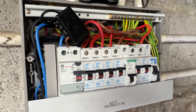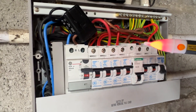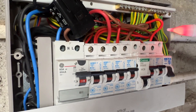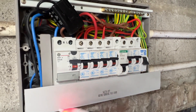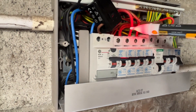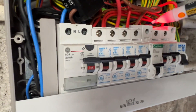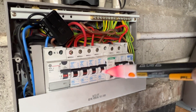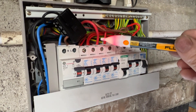All right, we'll try it in the fuse box — a bit of dodgy one-handed work going on. Here comes the tester. We're about six inches away and it's lit up. So that's a bit closer, but that's not going to help me in the fuse box. Obviously it's live at the bottom here — this is where the mains comes in through the fuses or circuit breakers. To try to detect an individual cable in here, you're not going to do it with this tester, which is a shame. I was hoping it would be a little bit more insensitive than the other one I tested earlier on YouTube. But no, not in a fuse box. There's a mass of live cables going on and bus bars, etc. I probably should have expected that, but I did hope it was going to get a little bit closer.